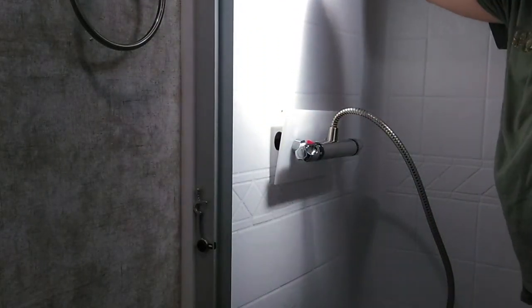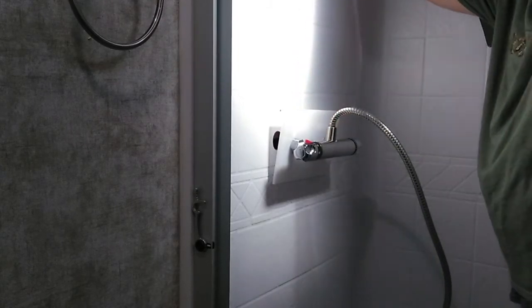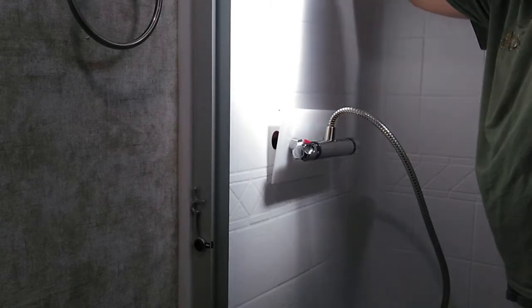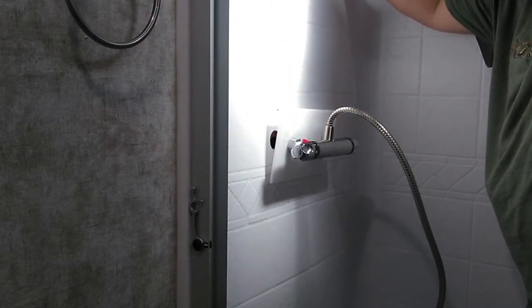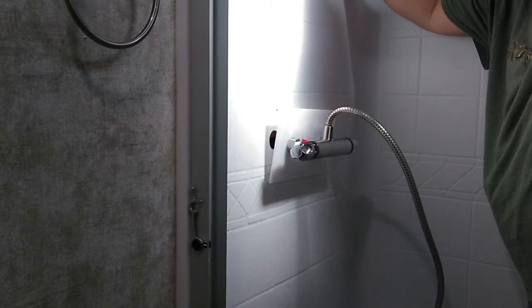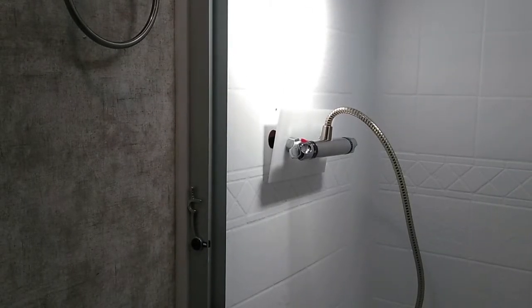We are hooked up to a water hose supply, but I've got that turned off for doing this job, and it's easier to tell if you have a leak or if you've created a leak somewhere with the water pump, because it will pump up the pressure, and if it's leaking, then you'll hear the water pump turn on and build back up and cut on and off and on and off, and you can tell. I'm going to have to try and listen to see if I can hear, but here goes the water pump. 3, 2, 1.